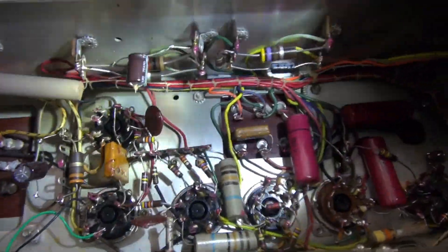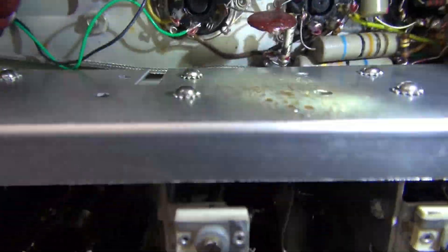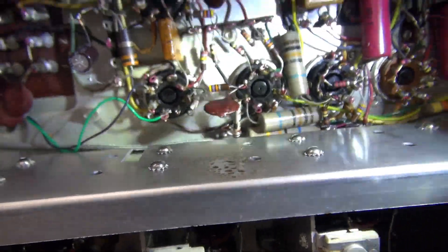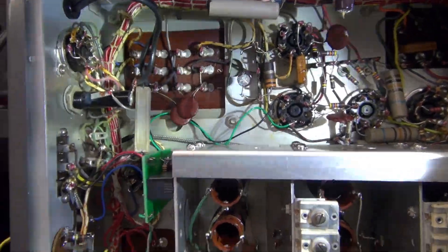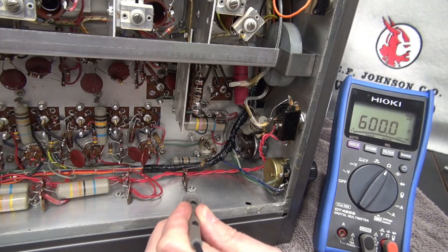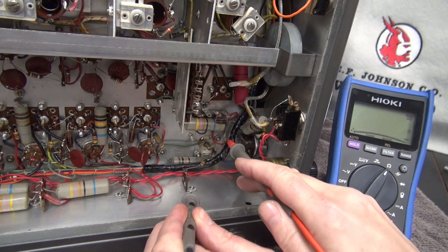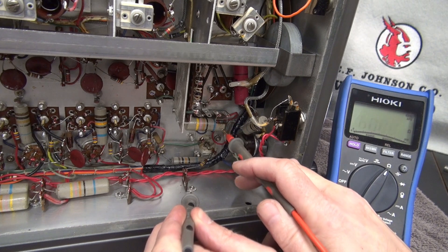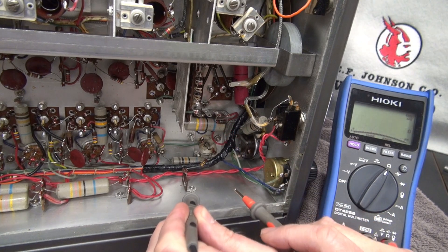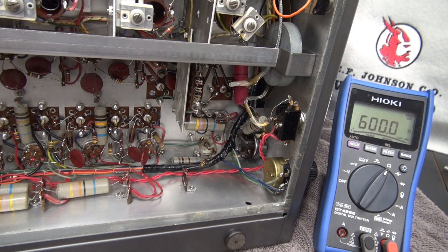But if we go up here, take a look at this electrolytic cap — he burst and went kerpawee over the chassis. So that was the noise generator, but it looks like my National 183D needs a little more attention. The bumblebee cap is definitely shorted. Here is ground, and here should be the high side — you can see it's just like the other side. The B-plus comes in, this guy shorted, and fried the resistor. I don't know the value of that resistor — I have to look it up in my manual. The cap up top that blew up, that one's written right on the side.